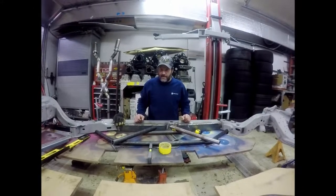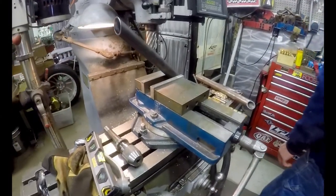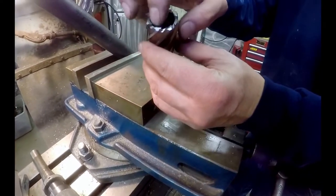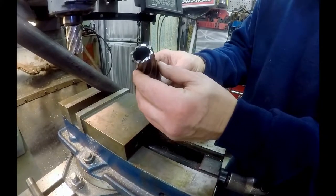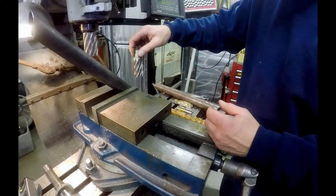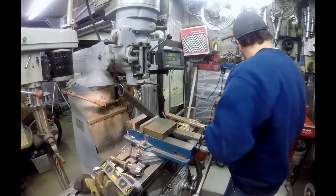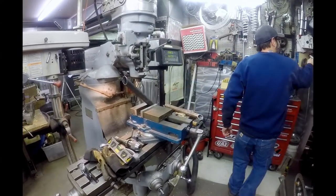Fitment is everything. It's called an annular cutter, and it's kind of like a hole saw, only way, way better. And it's got cutting tips like this. It normally goes in, there's a center pin that you would normally center up on a hole, but you can use one of these on a Bridgeport milling machine as long as you lock the table down both ways, and then we should be able to bore through here and put a nice cope notch so it fits the other tube well. So I'll show you a quick little trick that might get a little noisy.